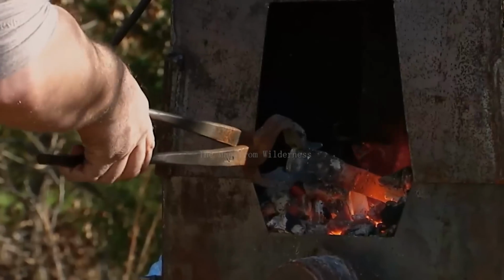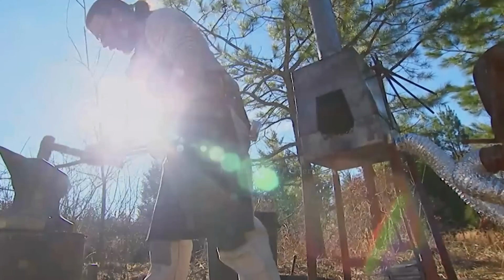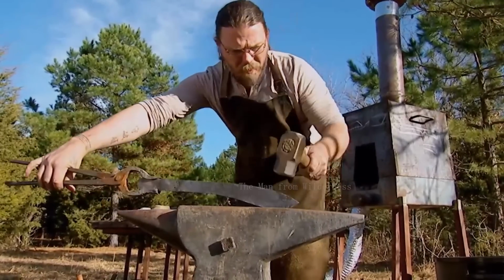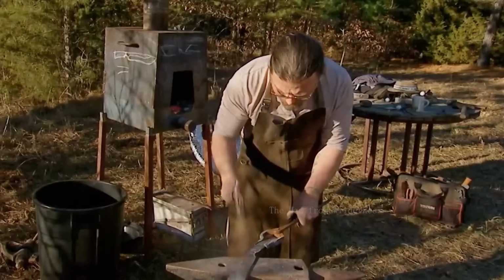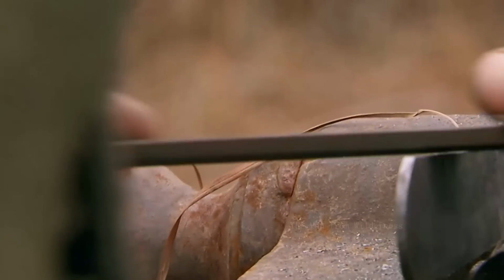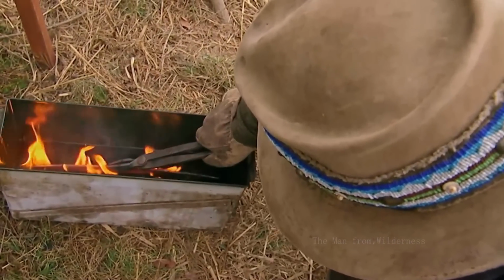The steel required repeated heating and hammering to slowly take the desired shape. After shaping, Jason polished the blade and heated it deeply for the quenching stage to harden the blade. Precise temperature control was crucial, and outdoors, Jason had to act swiftly and accurately to plunge the blade into oil, completing this within seconds. Thankfully, he succeeded.